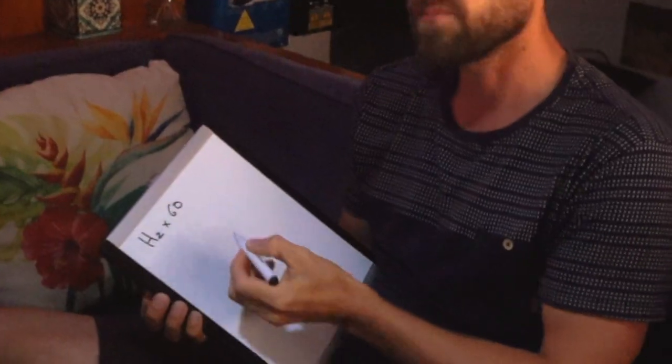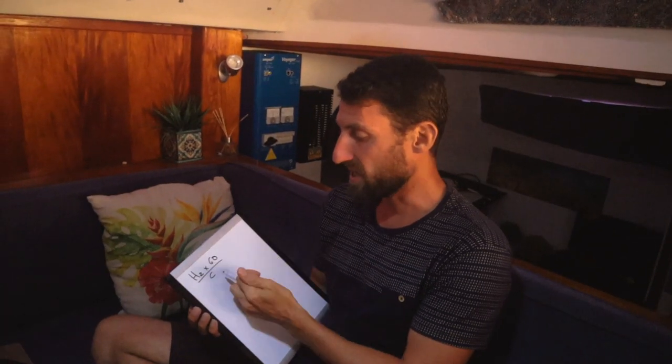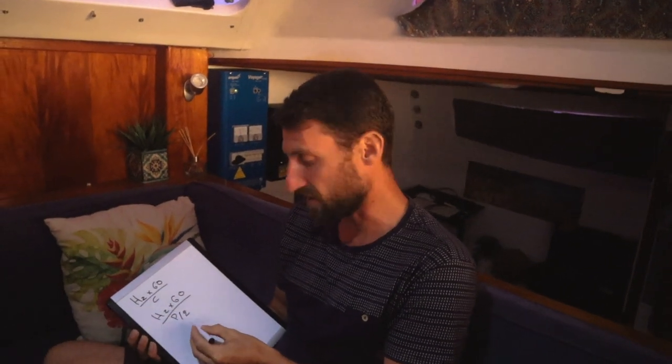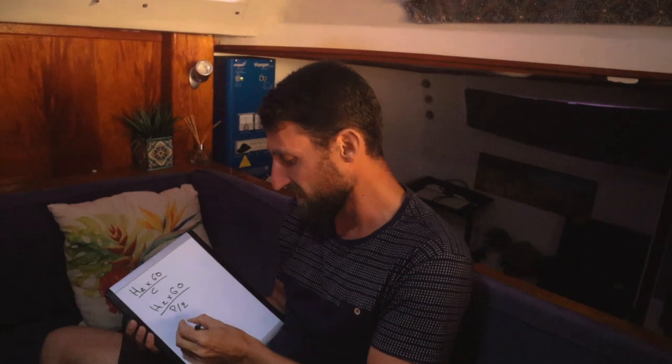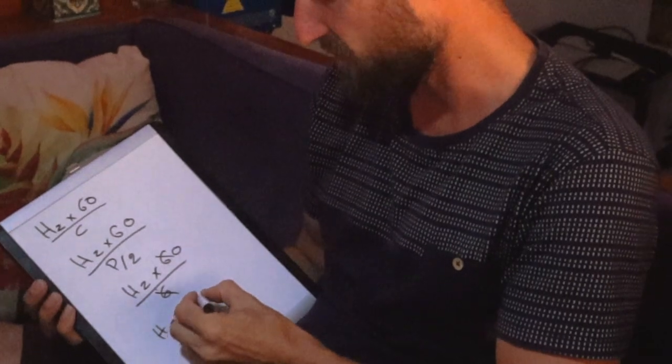To verify the RPM, let's do some math. Frequency in hertz is cycles per second, so multiply by 60 to get per minute, then divide by the number of cycles to get RPM. The engine documentation says 12 poles per engine, and each pole being negative and positive of a cycle means you divide by two to get cycles. So: hertz × 60 ÷ (12 ÷ 2) = hertz × 60 ÷ 6, which simplifies to hertz × 10. The RPM is just the frequency in hertz multiplied by 10.